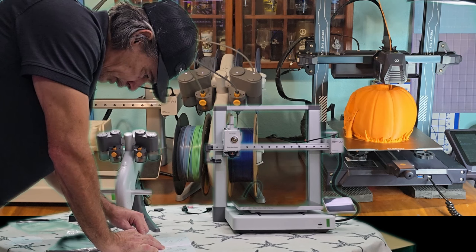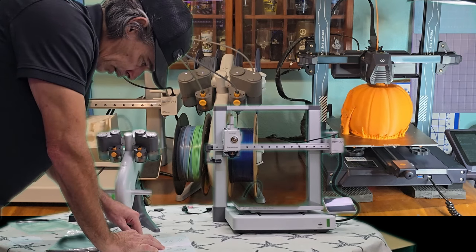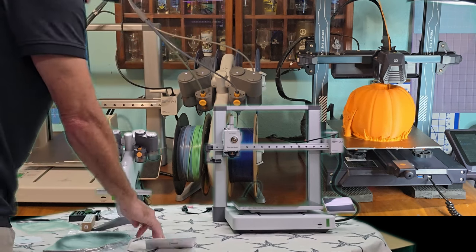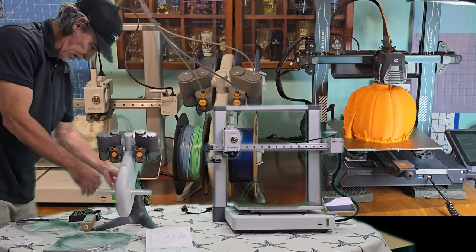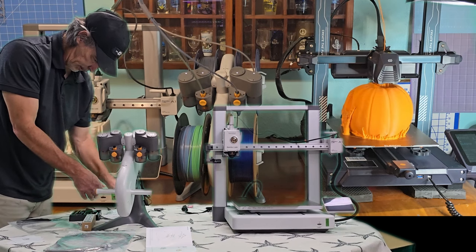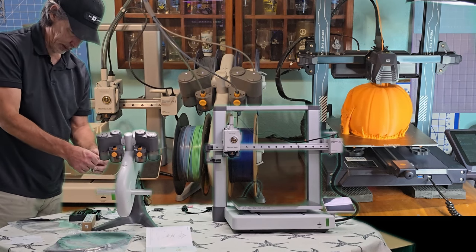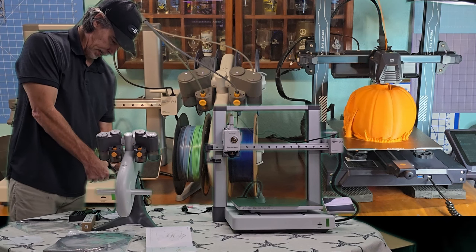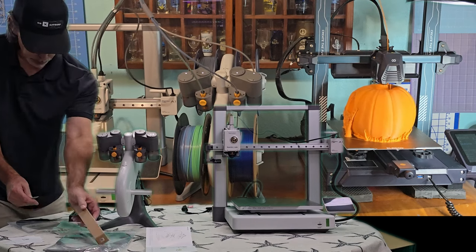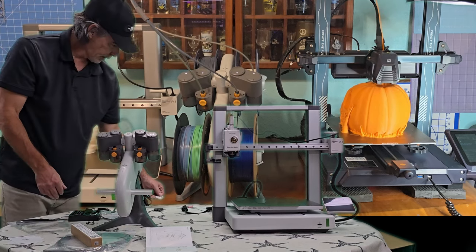Put the AMS light body on the stand, cable on the upward end. So that explains that. Secure the AMS light with the four BT3 6 screws for AMS stand from the accessory box. So we're gonna find the bag that says AMS stand. The AMS stand. It's right here. Hard fighting with the bags. Right there. Empty these out. Throw it away.